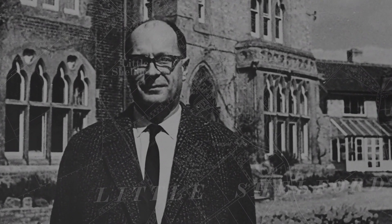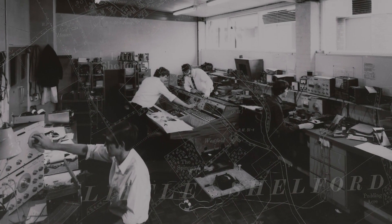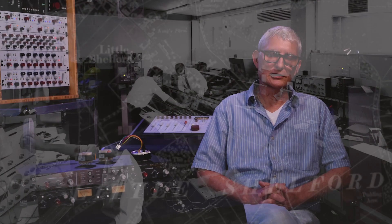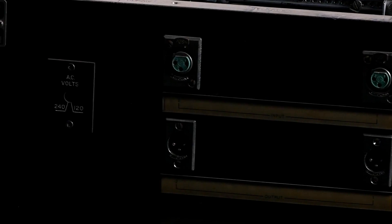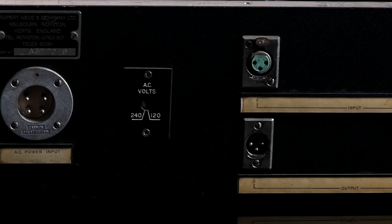In the early days, going back to the vintage Neve consoles and Neve recording equipment, they were very simple transformer designs — that was the technology known in the 1960s. The harmonic content and characteristics of the transformer were inherent and always present. Even at low levels there was a little bit of harmonic, third harmonic content, and as you pushed the transformer you got more third and started to add in second. That is what is characteristically known as the Neve sound.